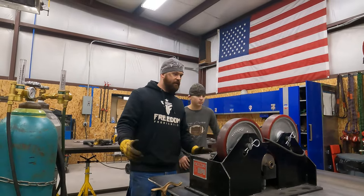It's gonna have to be under spring tension so that it pushes up on the roll, so that when the roll pushes down on it, that wheel has plenty of traction. I'm gonna take a piece of angle that's gonna mount to the bottom of this, and on the back side, it'll have like a bushing, and then it'll have a flat bar base with a piece of rod sticking up that runs through the bushing or the piece of pipe or whatever you want to call it, and then it will be spring loaded so that it pushes up. And I haven't got the spring loaded part worked out yet.